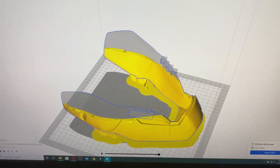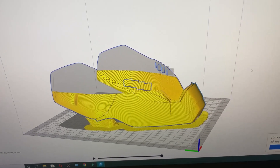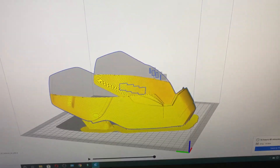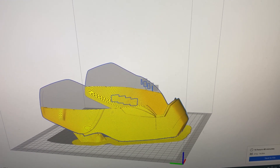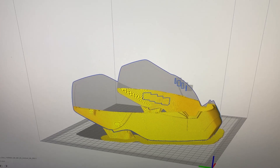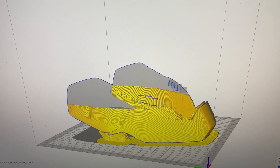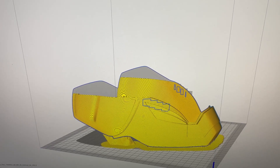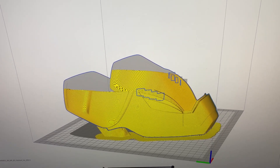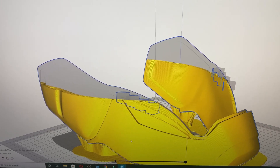This is the final — this is what I'm going with. Looking at it more as it prints, going through the layer stages, it looked better than the other models. It's about the same — 16 hours, give or take 30 to 45 minutes, and about the same filament use. But this is practical — it's flat and all of that. The weird thing was these blocks in the air, which are actually support blockers. I guess this is why tree supports are experimental. It wanted to make them go all the way up, but I blocked off supports from there — I only have them on the bottom.